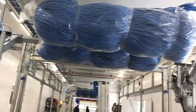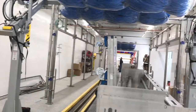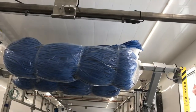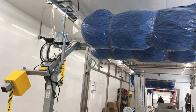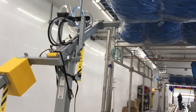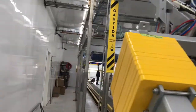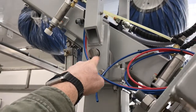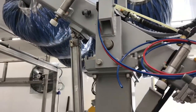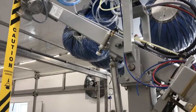One new thing we're going to be doing with these top brushes, we're going to use the ultrasonic sensor that's going to be mounted here to detect the height of the hood of the car, and we're going to put the brush down with a proportional air regulator and have an encoder mounted on. So as I was saying, I found an encoder that goes around that shaft, and therefore we'll know the exact position of the top brush on the entire vehicle.